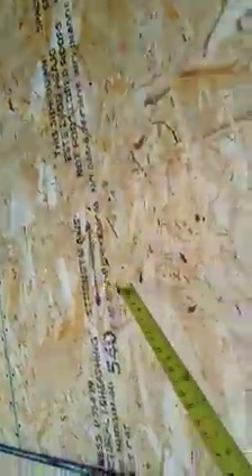Right here we got our ceiling joists — these are Versa-Lams. It's made up of compressed plies with glue, very strong, actually supposed to be stronger than natural wood that's milled out of a lumber yard. Right here we got a shear panel. The purpose of shear panel is to keep the wall from racking from side to side.